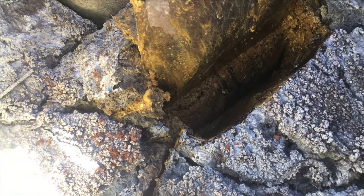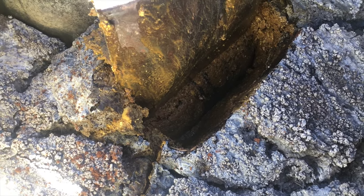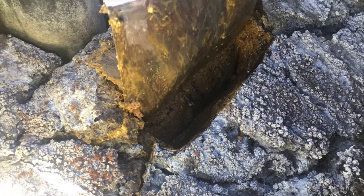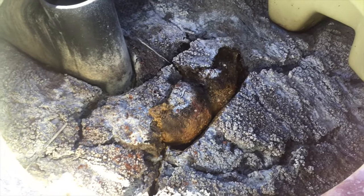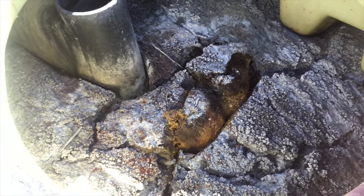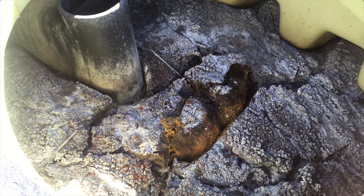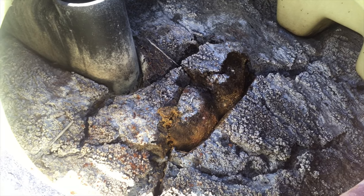At least a foot thick, so this definitely needs to go. Sometimes when you pull that open you'll see the water floating down there. A good way to decide how thick the crust is: about two-thirds of the crust will be below the water line. So if you pull that back and see two inches floating above the water, that means there's approximately four inches below the water, making your total about six inches thick.